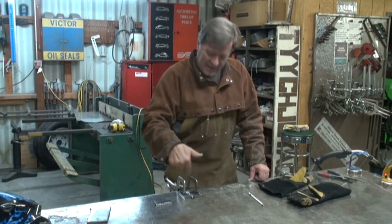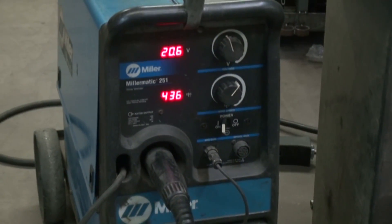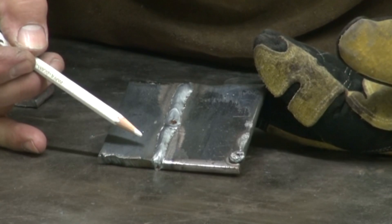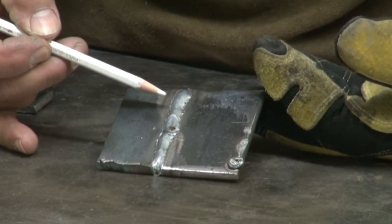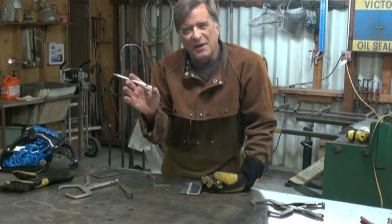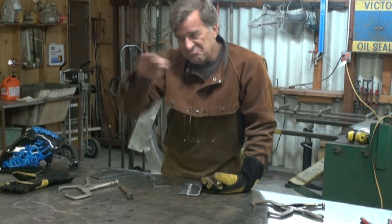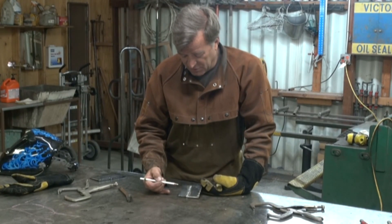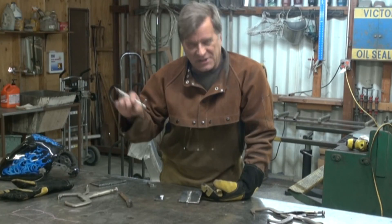Let me bump this up a little and make another run right there. So that was 20.6 volts, same wire feed. You can see — this was the first one at 19.6, and this is the second one at 20.6. Made it a little bit wider, just by going up a volt. Still got that little raised hump in the middle, that little peak. So maybe a little less wire feed, a little slower travel speed. Lots of different variables — there's really no cut-and-dried solution to it.